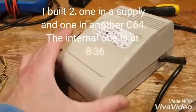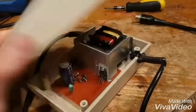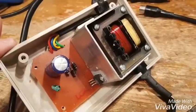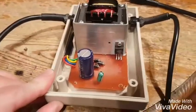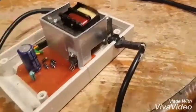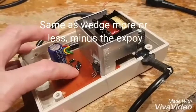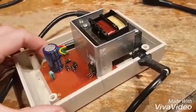This is an aftermarket PSU Micromate. It's a lot better than the original ones because it allows the regulator to cool properly. It's a lot more nicely laid out. So what we've got is a 9V AC — it's not plugged in at the moment — which goes through the caps, through the rectifier, stored in the cap, out to the yellow and green.